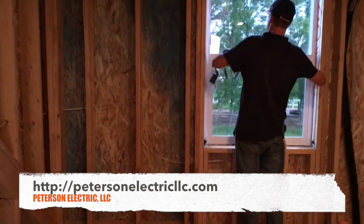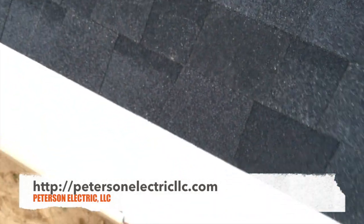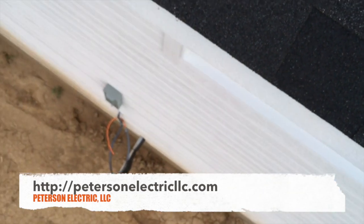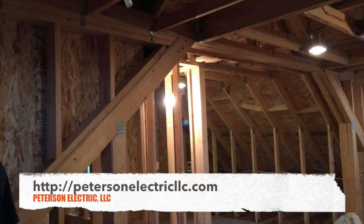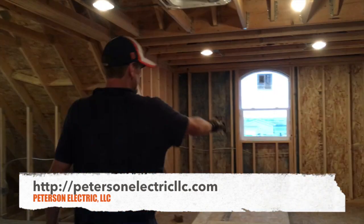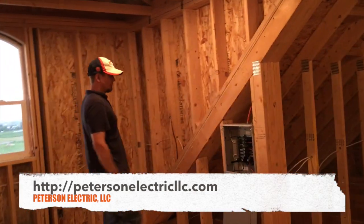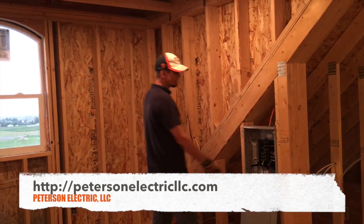You come out of the disconnect and go all the way back up — it was rated at 25-amp max load on the breaker. There's a disconnect there and below that is an orange cord; we got flex back in there because power comes out of that AC and goes back up to control that fan. That's why it's got two cables in and out. They may put in a kitchen later and turn this into a mother-in-law suite, so we put in a 50-amp sub panel up here — again six-4 — with AFCI breakers.